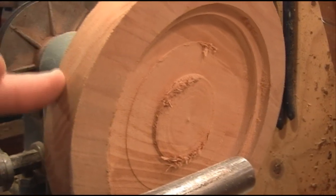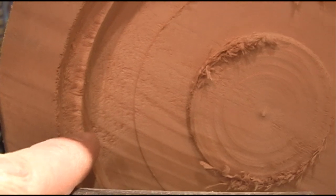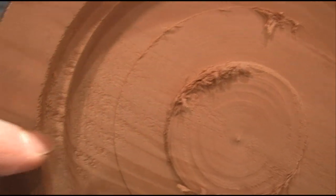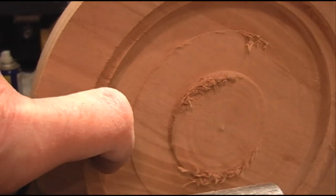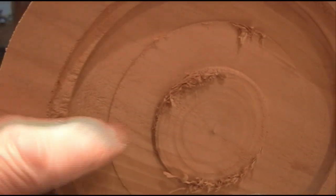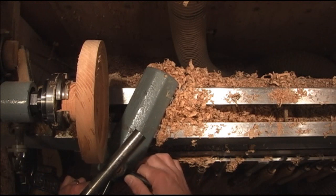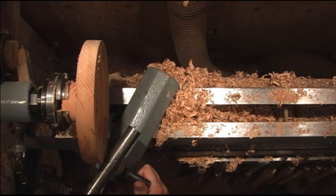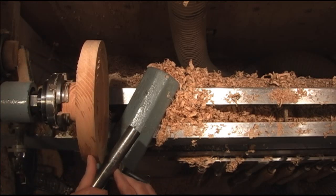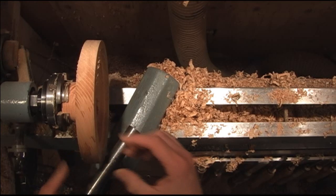That way we'll leave a little bit of waste here and then we can use that to remount it and turn the face of it. That's what I mean about leaving the lip here. Then we'll go ahead and sand up the whole back side, just like we do on the compact, and probably go in a little bit deeper here and then come in from the side. I'm not going to leave the rim this wide, so I'm going to bring it around and come in right about here so that we can cut it off and still use this to remount it.